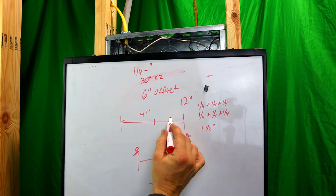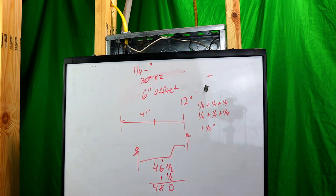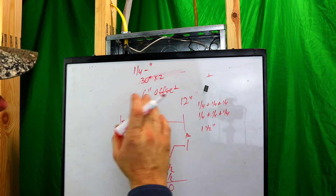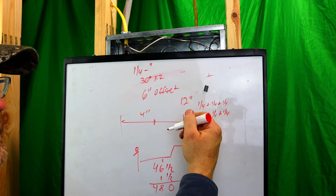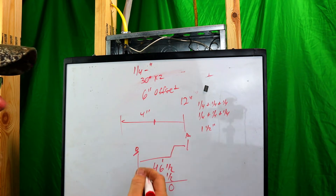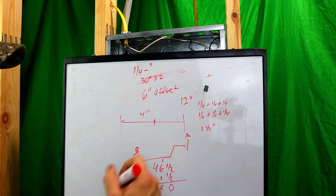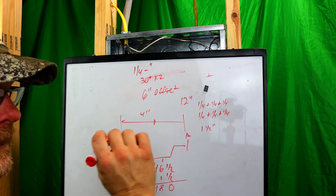You've lost an inch and a half on your pipe, so you're going to have to compensate. If this was a four-foot piece you'd have to add another inch and a half to get the full 48 inches. So keep that in mind — if somebody gives you a measurement and says the middle of pipe needs to come back 26 inches, you're going to have to go an inch and a half more than that to make sure you get the bend in the right spot.